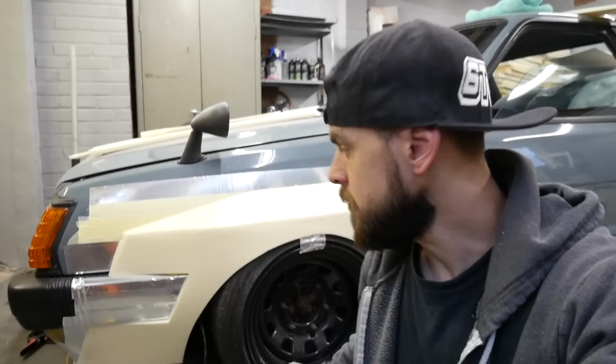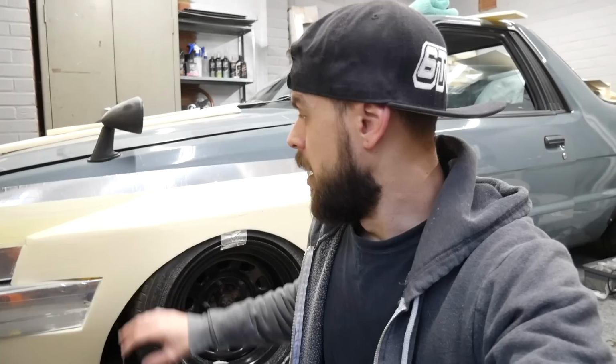So with this stuff now, once that's on there, I need to kind of shore it up and make it better to work with. Now what I want to try and do is release off of this. So I've been advised to cover it in one layer of fiberglass tissue, which is really, really fine, really thin, as you can imagine, like tissue, obviously with resin.